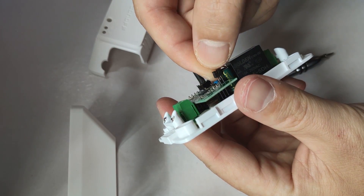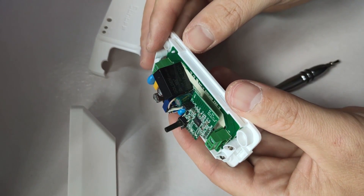So that's what we're going to do. Now the R3 design of Sonoff Basics comes with a couple of things. First of all, the module itself is redesigned, so it has a modular design inside and consists of two elements. There is a relay board and there is also a connectivity module that supplies the connectivity like Wi-Fi, RF, or in the latest one, Zigbee. Another thing that makes Sonoff R3 stand out from other Sonoff devices is DIY mode. There is a small jumper that you can utilize to actually enter DIY mode. If you want to know more about DIY mode, I cover it in a linked video — click on it and you'll learn about its shortcomings.